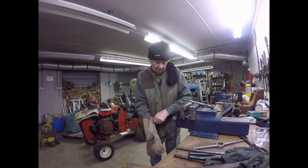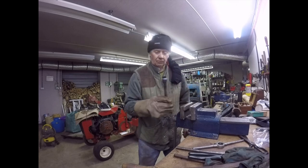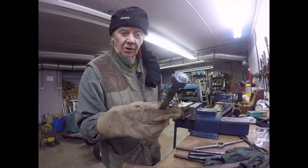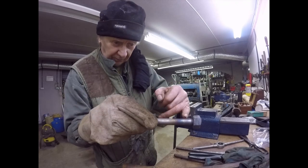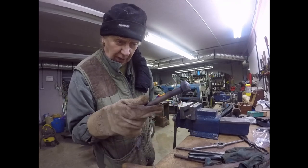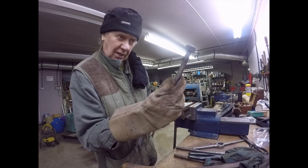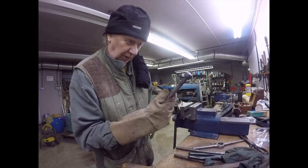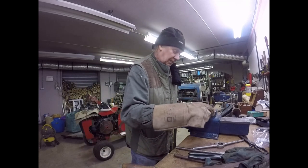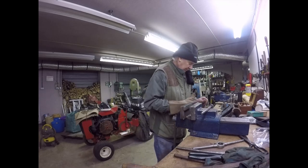Right, here it is, he said, putting on the glove. Nicely TIG welded over. I'm just going to stick it in the chuck when it's cool and just face the back of the nut off, just to get it flat, because I noticed that it's a bit of a crappy shaped nut, which is why I picked it, but it's also not flat now, so I'm going to shave it off until it's flat, and then that's job done after a bit of a clean up.